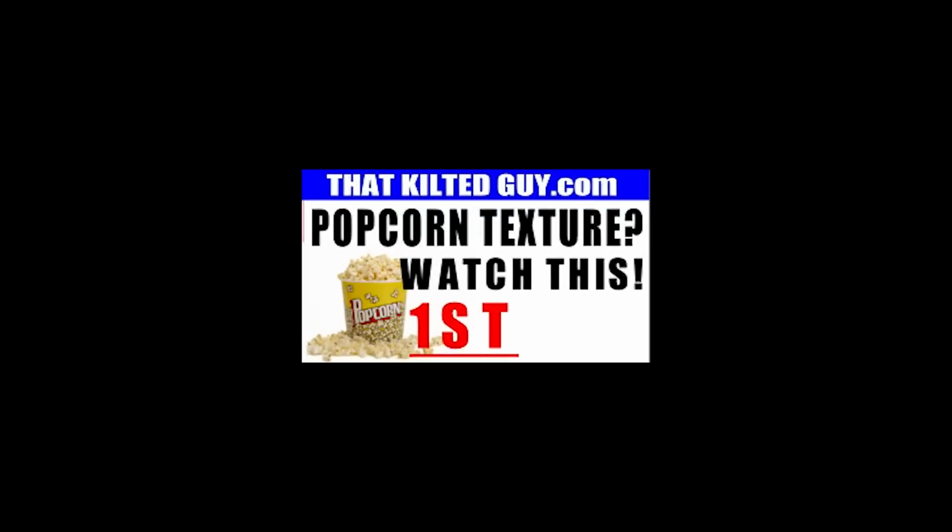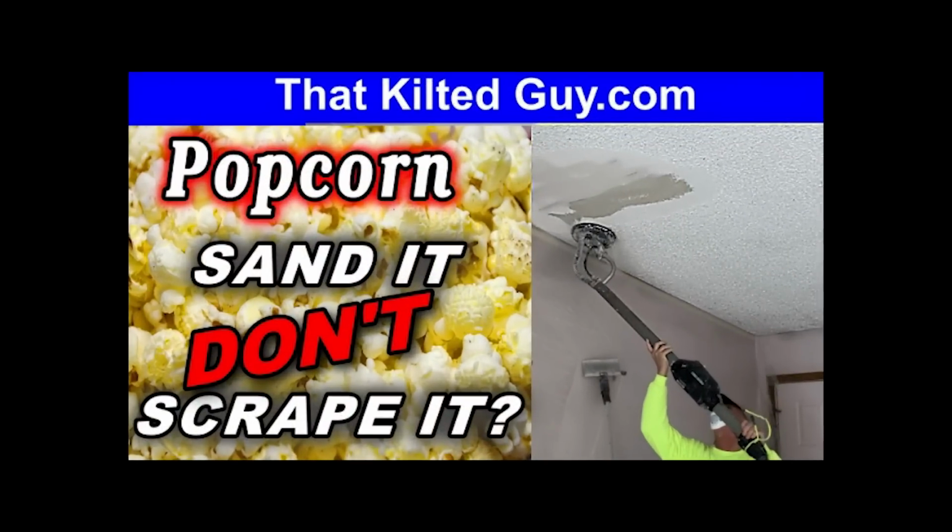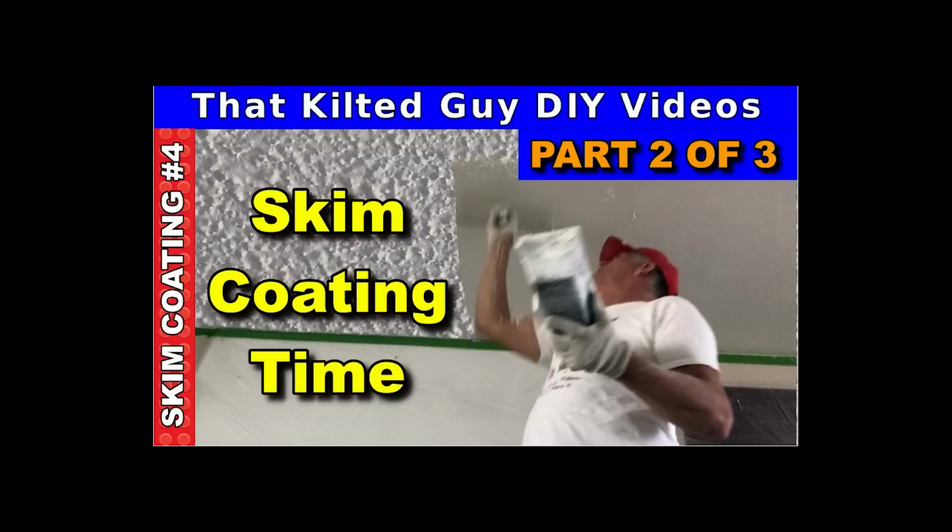The first thing is to decide how you want to get rid of the popcorn ceiling. Do you want to wet it and scrape it and do it that way? If so, look for this video and this thumbnail. Or do you want to avoid the water and just sand it off and deal with it that way? If so, look for this thumbnail. And if you just want to not remove it at all, you can skim coat it and get rid of it that way. So look for this thumbnail, and this is good for if you have asbestos or it's been painted too many times.